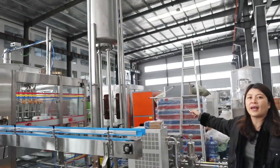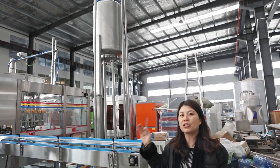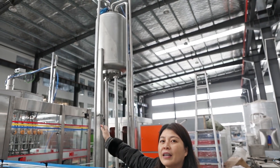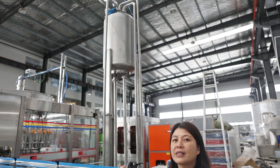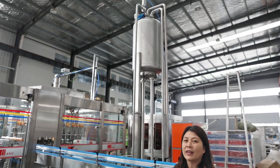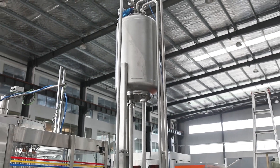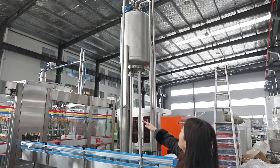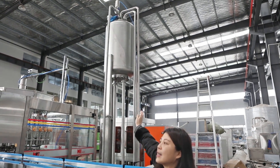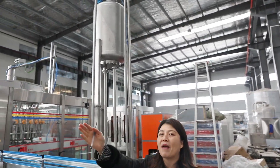This is the liquid tank of the filling machine. It is very different from the traditional filling machine. Normally, in a traditional filling machine, the liquid tank sits on top of the filling machine. But during operation, when the filling heads are moving, the tank can shake and cause foaming inside the tank. To avoid this, we have made the tank a separate part away from the filling machine. This tank has a volume of 400 liters. The liquid comes from the beverage mixing machine.